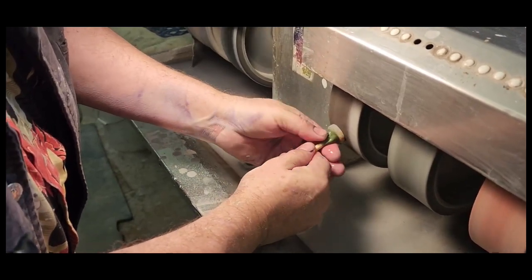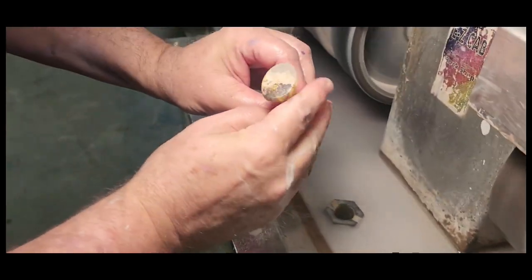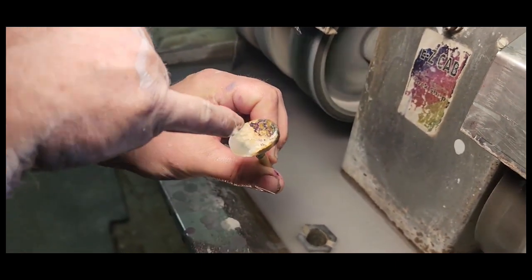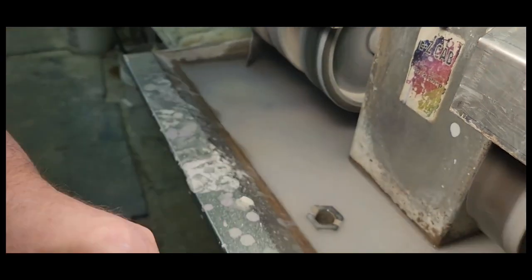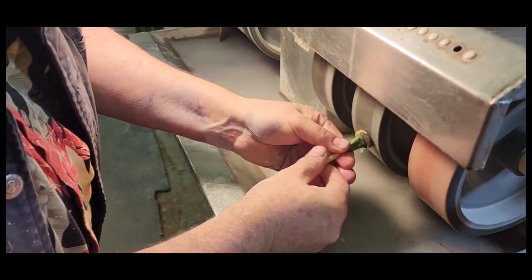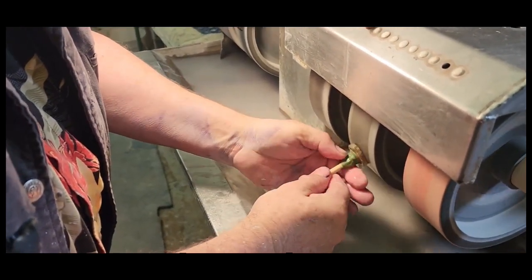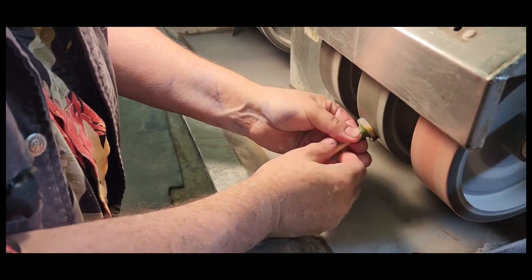If you're pushing too hard it will miss the center. This is what it should look like — smooth, no scratches. These are sweep lines from my finger, so this is smooth enough. Look at the reflection — you can see the little gold wires in here. Just keep moving down the line. It takes 25 to 40 turns for a hard rock on any of these wheels. If you get very good at it, you can tell just when you're ready by looking at it.